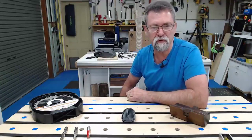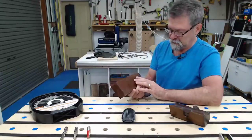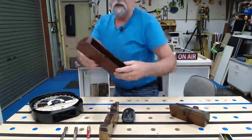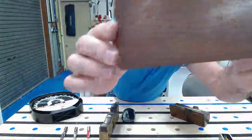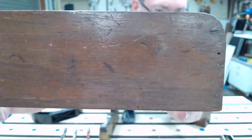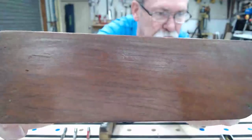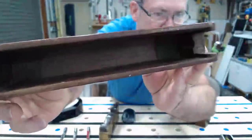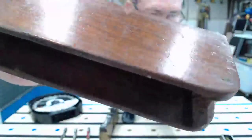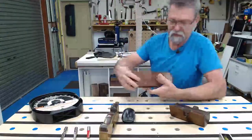How did he connect the edges of boxes? Looks very durable and neat. You know what? Nails and glue. Panel pins and screws up the top. I'll show you the box. So, corner of the box, coming the other way, there, coming closer. Screw at the top, panel pins down the side. Joined across the bottom, panel pins again, and glue, panel pins, and inside, this is where the screw is. Come on, focus. And the felt down inside. Amazing. I love it.